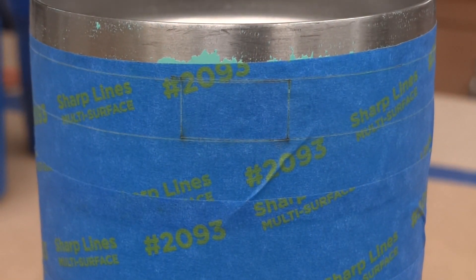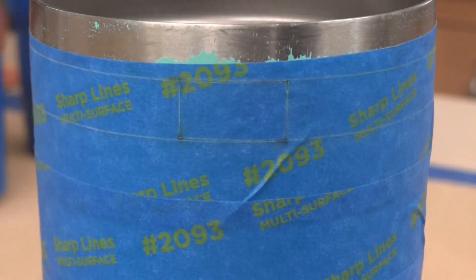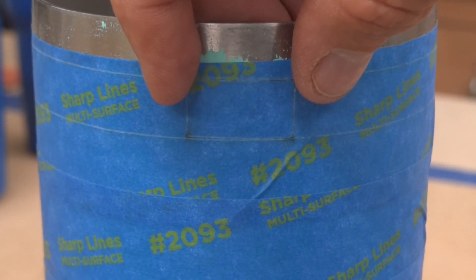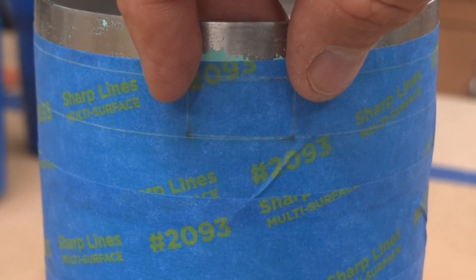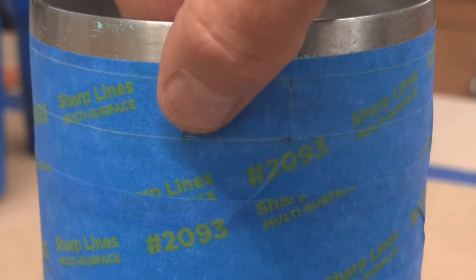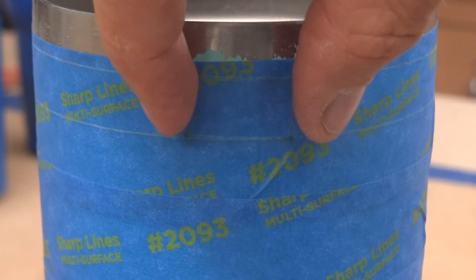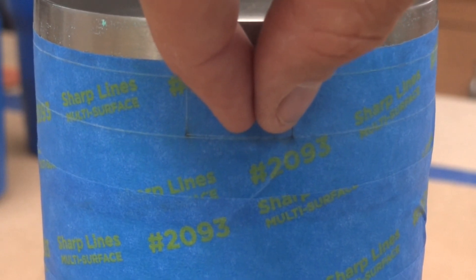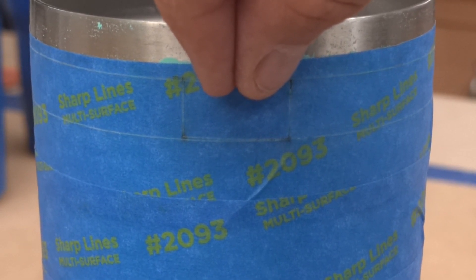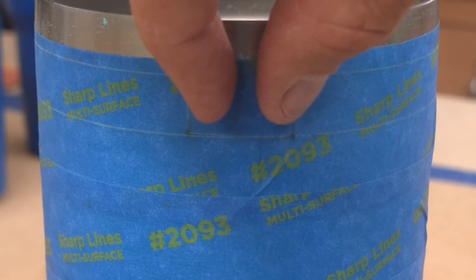We did our first test pattern, and you can see that we've overlapped this rectangle by about three-quarters of an inch to an inch. So we know that 4,400 steps per rotation is too much — this is overlapped by that much. We need to reduce those steps per rotation to get these two ends to not overlap but just connect, so our layouts will be dialed in. We're going to reduce the steps per rotation and see if we can get this horizontal overlap to shrink until they touch.